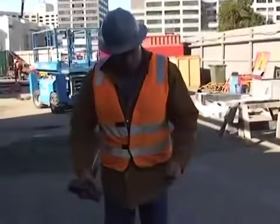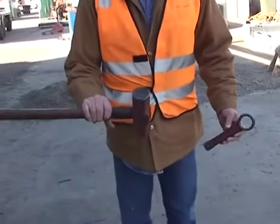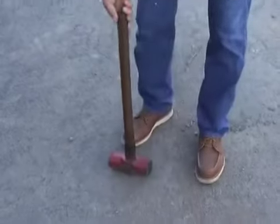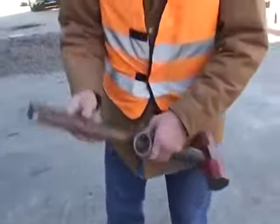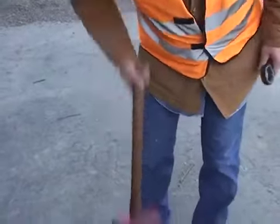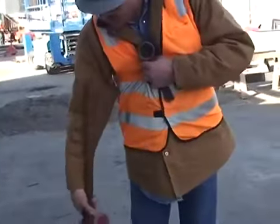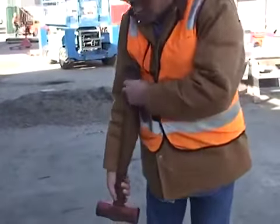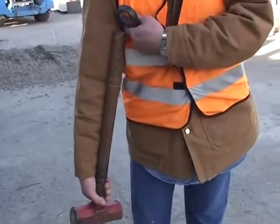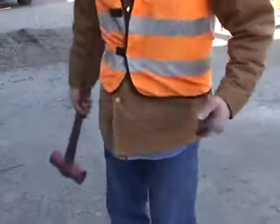Tools that are commonly used in the industry: a flogging spanner and an 8-pound hammer. When we use the 8-pound hammer, there's always a danger of it slipping out of your hand, so the riggers tend to use a grinder and put screws in the end so your hand doesn't slide off. And another trick for swinging your hammer with one hand: put the hammer up and hold it close to the head like so, and then cut the handle off even with the underside of your armpit. And then you can swing this hammer with one hand without hitting yourself in the stomach.